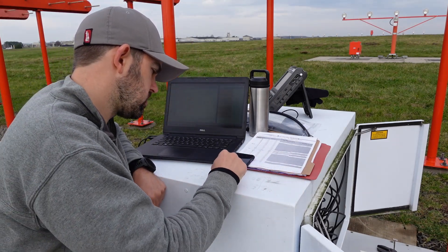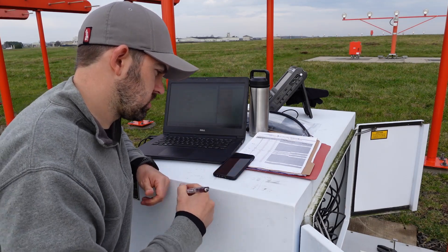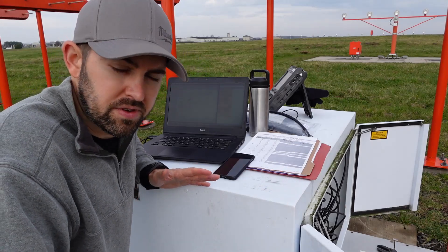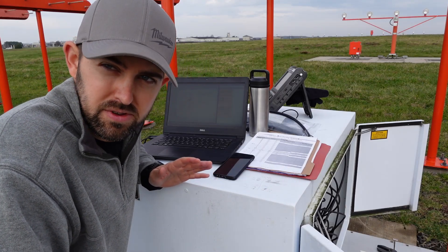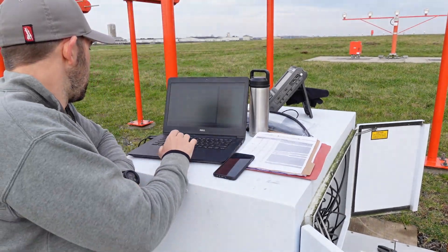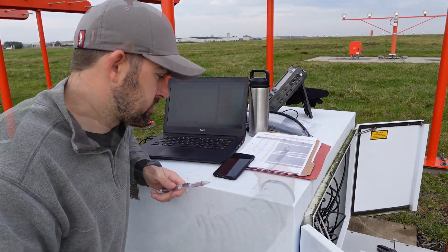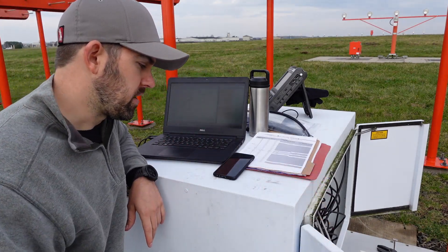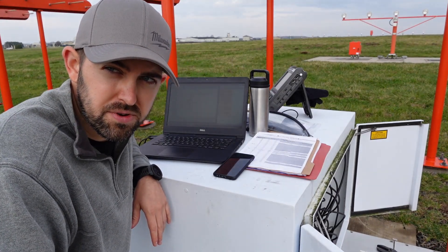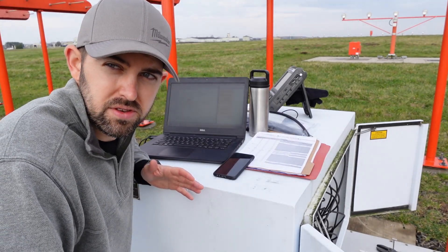155. For transmitter two on the 150 side we've got a 155. The other side — the 90 — was a 153. So we've got a 308 on transmitter two. And transmitter one is also a 155, so 308s on both transmitters. And that's going to get our facility references for this localizer.